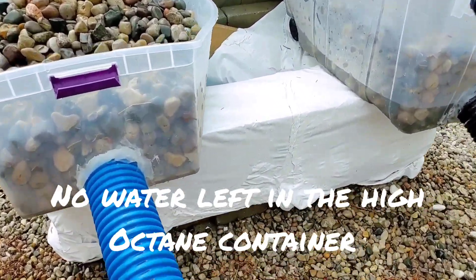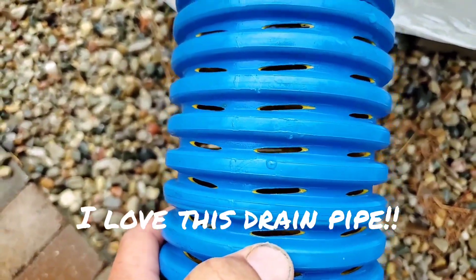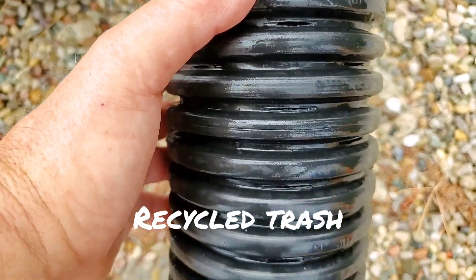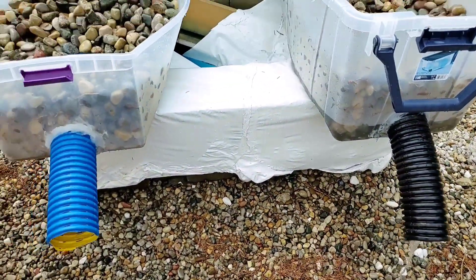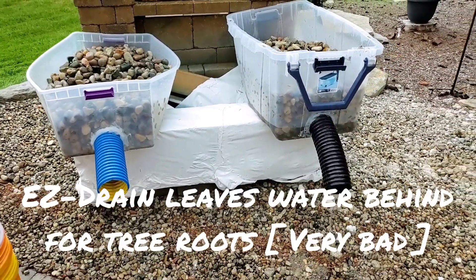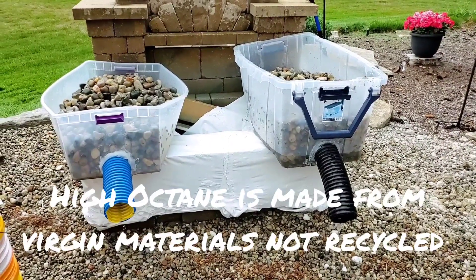That was cranking. The difference is the inlets — look at these monster inlets, just insane. The peanut pipe doesn't have big inlets; nothing about it really screams that we're going to move a high volume of water. Even the aggregate — that's only three inches of aggregate around this pipe, because it's seven and a half inches altogether, and the pipe's four and a half inches outside diameter.